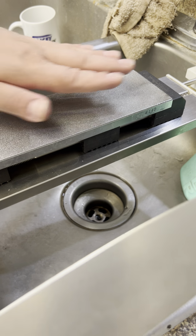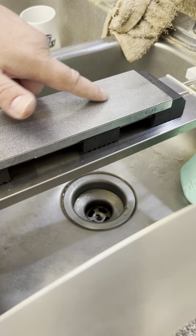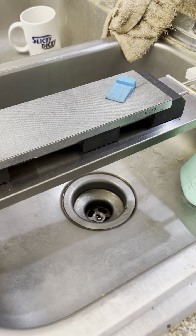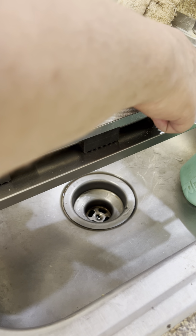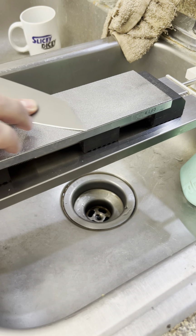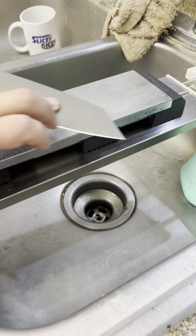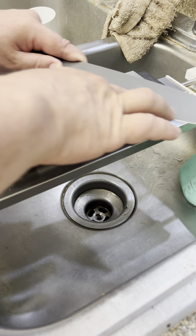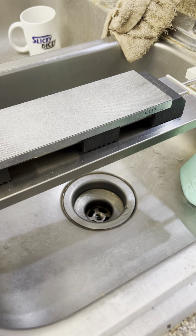And if you don't go fast enough, especially on the rougher grits, the diamonds can actually move your blade out along some of those ley lines. The ley lines not being like energy lines or something, it's the lines that the dots were laid around. It might push it, so there's kind of a smoothness it requires. If you learn on Atoma, you can sharpen on anything, but the feedback will be different and probably lacking.